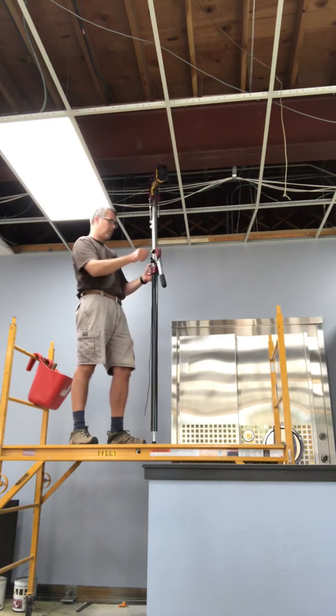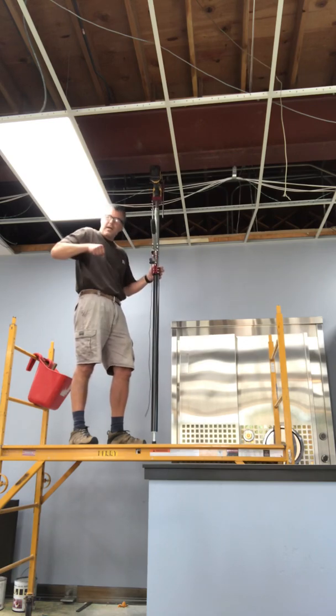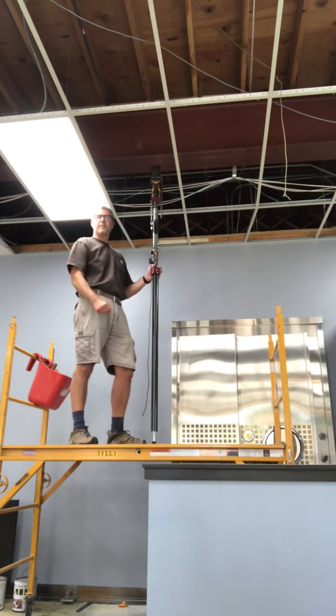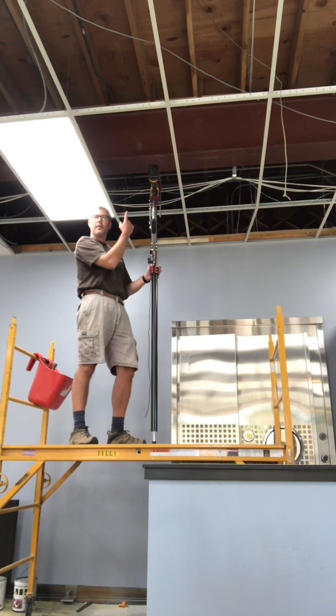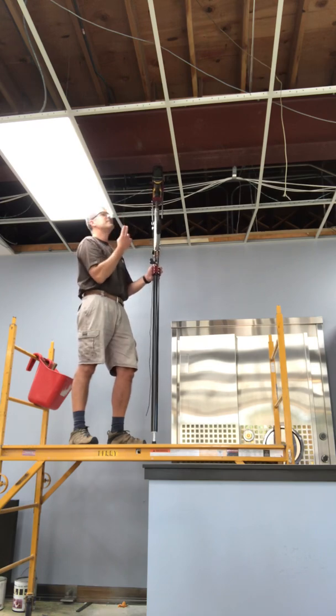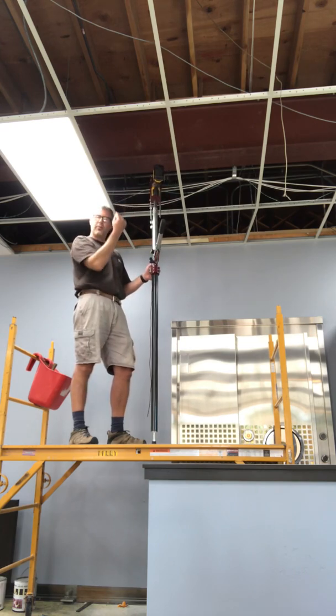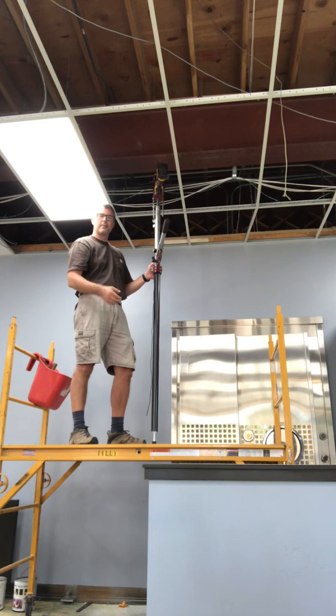So let's drill a hole. One last thing — I'm on medium speed and I'm not going to put a lot of force drilling through that half inch steel, because what happens is when I plunge through, the flutes on the drill bit suck me up and I don't want that. I just want it to penetrate through so I can lower the drill back down again. Just let the drill bit do the work.